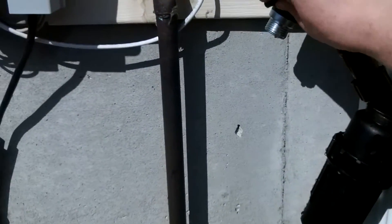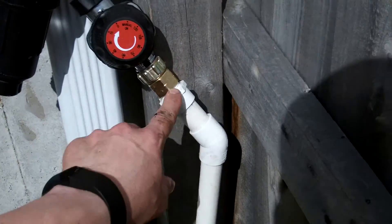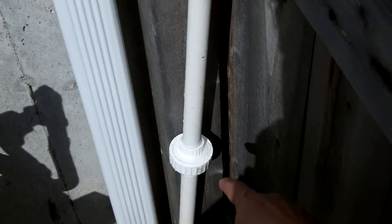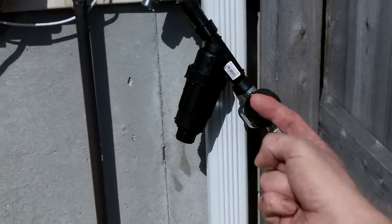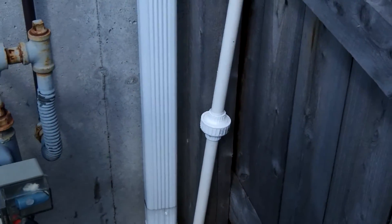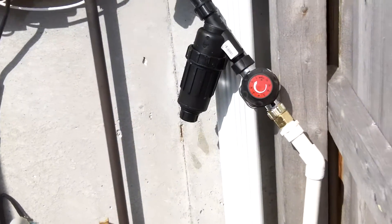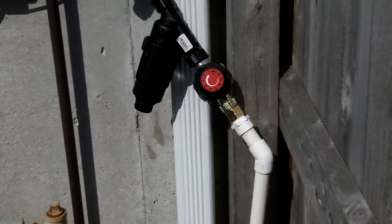So we've done a little bit of testing here and you can see a little bit of water dripping — I'll just turn the system off. I am having just a slight little drip here that I've been working on tightening up, but so far everything has worked very well. What I ended up doing was I couldn't really get this angle right to get it 100% on, so I did put a union in. What that allows me to do is break the connection so this whole section goes free — I can connect it up to the hose mechanism and then line up the union and it'll pull it all together. That works well. Unions are real nice; they're about $3.50 a piece, so they're a little expensive as far as PVC pipe parts go, but it is what it is. So far it seems to be working out alright. That's sort of the whole thing — from here I just need to put in all my poly pipe and stick in my emitters.